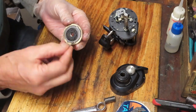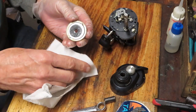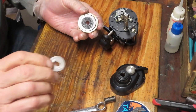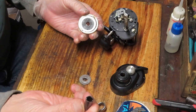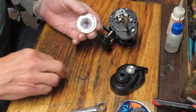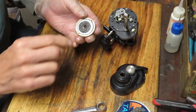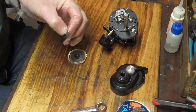This is your inner workings of your gear then. You have a short one up top. There's a bell on this top washer. You want to note that. It's a raised surface as opposed to an indented surface. The raised surface faces up. This is your collar for your anti-reverse gear. It's got 2 studs that go on the bottom of it, and that's going to fit inside that AR clutch. Small washer next. That would go into that.